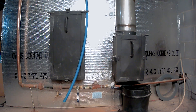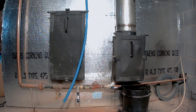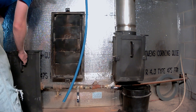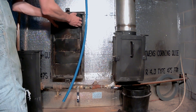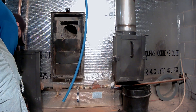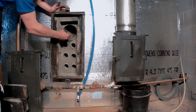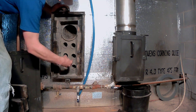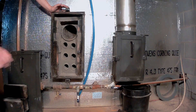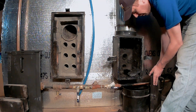This is the back side of the boiler. On the right side over here, this is the side that goes up to the chimney. On the left side, this is the side that comes from the burn chamber and goes out to the front. We'll pull the covers off here. This is in between the first and the second pass, so that's why there are these bricks — these fire blocks — just because it's the hottest; you're probably up around five or six hundred degrees at this point. This is where we'll get the most creosote; this is the biggest buildup.